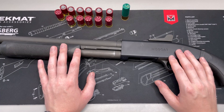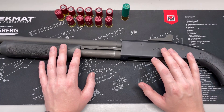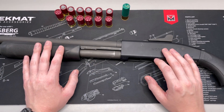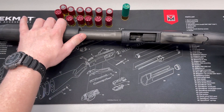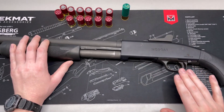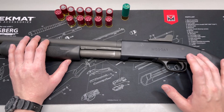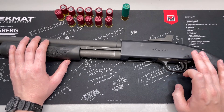The firing pin is removed from this firearm. We're going to be loading this up to the full 13-round capacity using mini shells and then do a test run. This is a relatively new adapter — we've only had maybe one or two magazines cycle through it before — so we'll load it up, do a control test, then hook it up to our test rig and try to run it to at least 10,000 cycles or until we see some sort of failure.